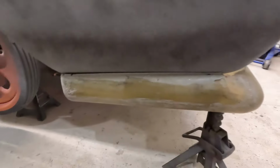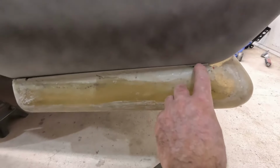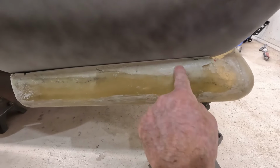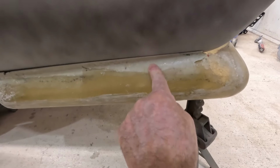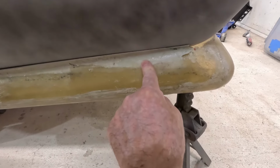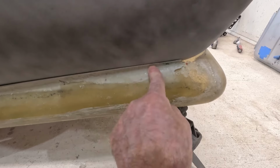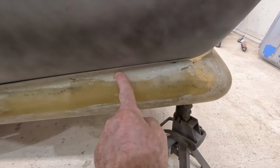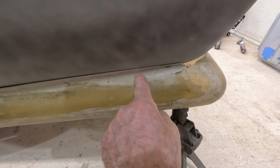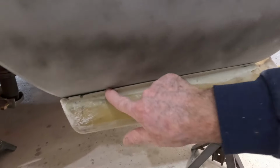They still look good. Very little work left to do to them now. But when I made this, I got a little too much goop. This is glass beads and a micro fiberglass that you mix in with the resin, and it makes a Bondo sort of thing, except it's fiberglass, and it's extremely strong. It's not like fiber fill or any of that kind of stuff. It's fiberglass, and it is super strong. But it's something you mix up yourself, and that's what I'll use to fix all this and tighten this gap.